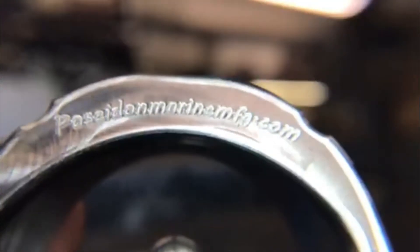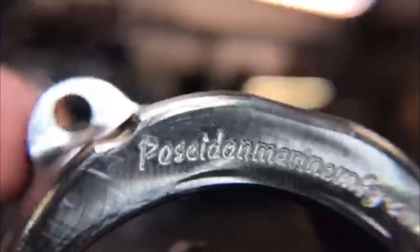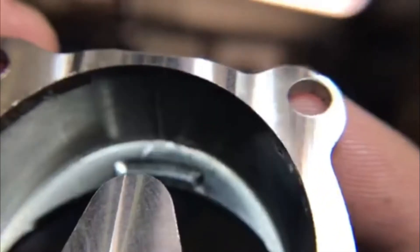I've got my close-up lens on here right now. That's engraving on this — this is the first one with the screw holes. Let me go over a couple things I've changed on this one. Lead in/lead out — you can probably see there's a pretty big gouge in it. Shout out to NYC CNC John Sanders for his video on lead in/lead out in Fusion, that helped me quite a bit. On this one I'm actually leading in and leading out right there — you can see — and I'm doing the overlap and changed the angles, it's very very minute compared to this one.